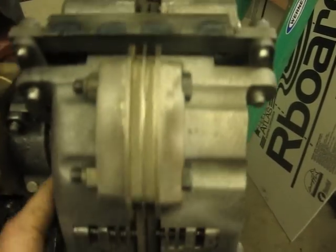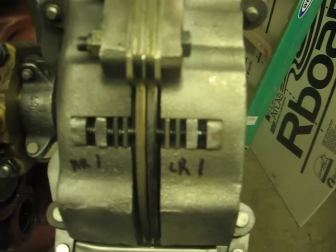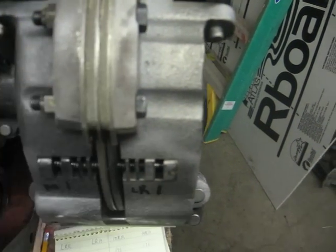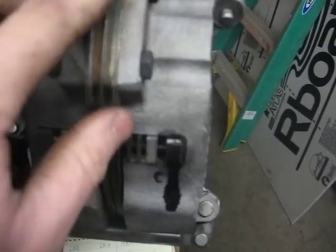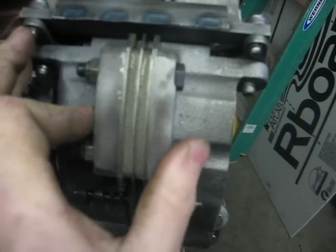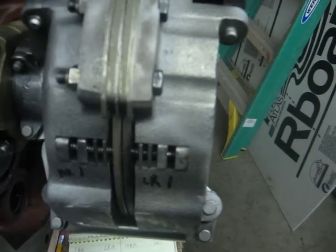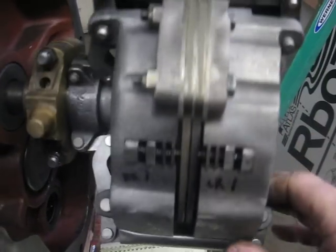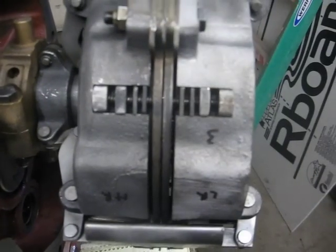I've got some spares here but not enough to do what I need to do. Since the tractor wasn't running, I took the clutch pack apart, cleaned everything up and the shims, and basically started over. When you start over, always start with 85, 85, 35 - that gives you 205 thousandths worth of shims, and you do that in all three locations. Always maintain that 205 thousandths worth of shimming. To take 20 thousandths out of the clutch pack, you've got to add 20 thousandths between the two center plates. I hope that clears up some confusion - it's really not too complicated once you get into it.